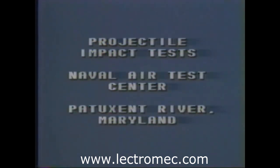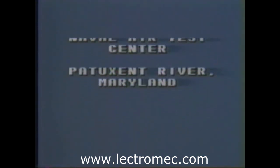In addition to the tests conducted at the Naval Research Laboratory, another series of bullet impact tests was conducted at the Naval Air Test Center. In these tests, the wire harnesses being shot were powered with actual aircraft generators and the complete power circuit components of the respective aircraft. The wires of the harnesses were connected to resistor loads to more nearly simulate the devices powered by these wires in the aircraft, and were routed through the appropriate circuit breakers as seen in this panel.